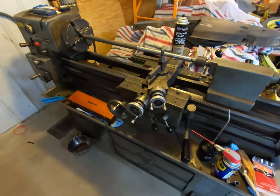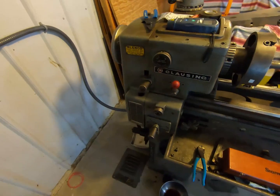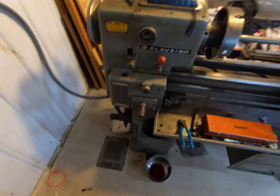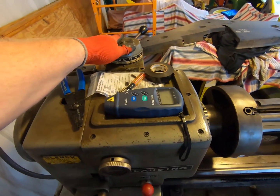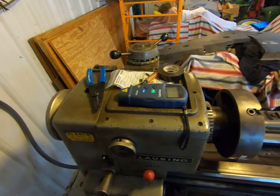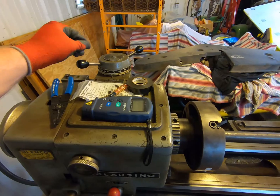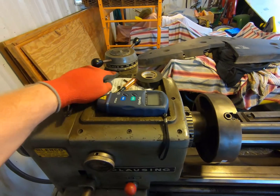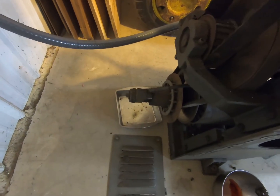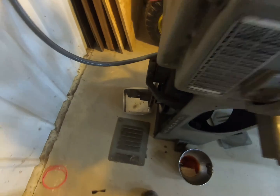It did come with a lot of other things. I'm not very good at this — flat out terrible, honestly. I've got a couple of repairs to do. This is the variable speed drive, and the spring is broken in here, so I'm going to try to call Clausing and get a new spring. The variable speed drive actually works very well and it's pretty impressive once you see it, but right now it just turns 360 degrees freely. Also, a couple of the seals down in the variable speed mechanism are leaking — that's why the catch tray is there.